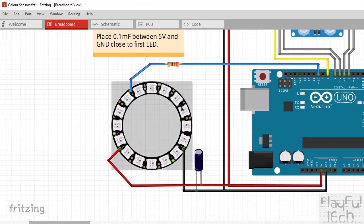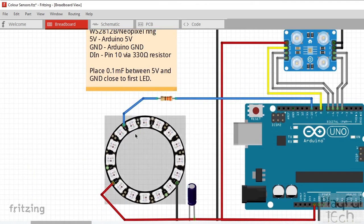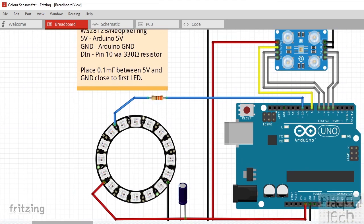For the LED ring, I've got 5V and ground supplies, and I've also got a capacitor placed close to those inputs — between the 5V and the ground line. This is a 0.1 millifarad capacitor, and it's always a good idea to have one, because when the LEDs first turn on you often get quite a current surge, and this capacitor helps fulfill those requirements. We've then got a data-in signal line going to pin 10 on the Arduino, with a 330 ohm resistor — anything between about 300 and 500 ohms. You shouldn't connect data-in straight to an Arduino output; it may work, but you risk damaging your NeoPixels. It's always best practice to have that resistor just before the first LED in the strip.